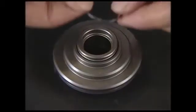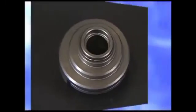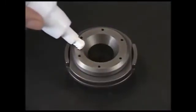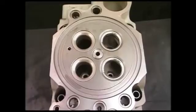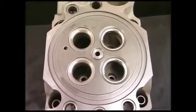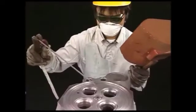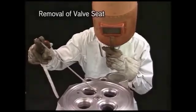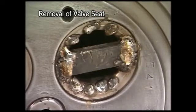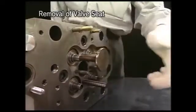If there are any damaged parts, replace them. At this time, mark on the rotator so that it is easy to check the revolution work during a run. Check the valve seat and if it's over usage limit, renew it. Build up the whole circumference of the valve seat face by arc welding to remove the valve seat. If it is difficult to remove it, further weld an iron plate and hammer out the valve seat through a round rod driven into the valve guide.